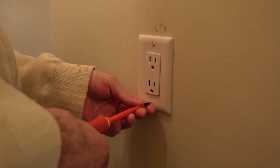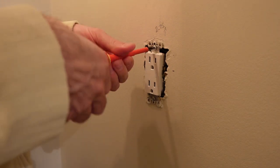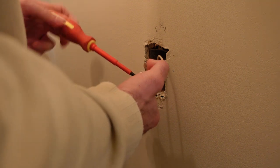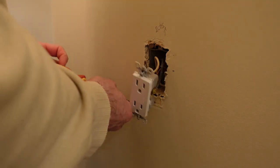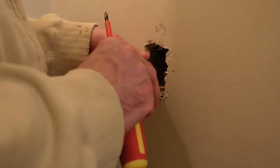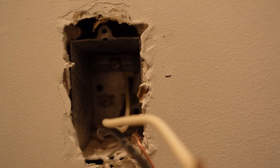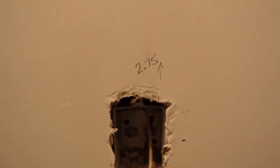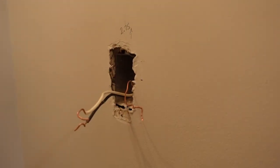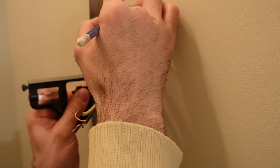I do put a great deal of this video in fast motion. First I'll pop off the outlet cover and pull the outlet out of the box, then disconnect the hot wire (black), the neutral wire (white), and the ground (bare wire). If you're not confident working with electrical, this may not be the job for you. The wire is actually coming from the side, which makes it easier to raise the outlet up.